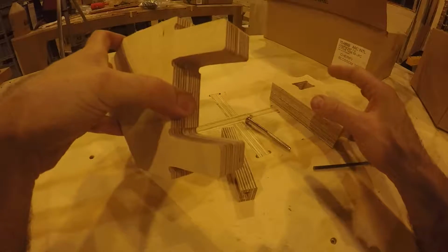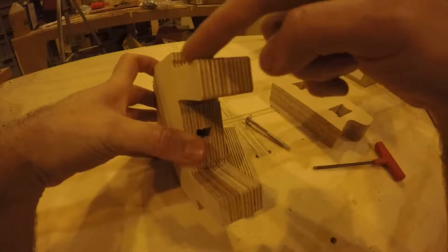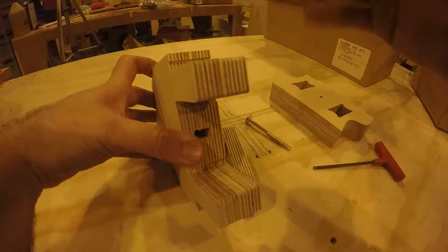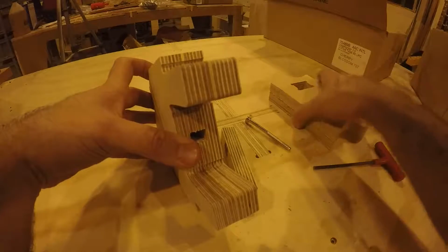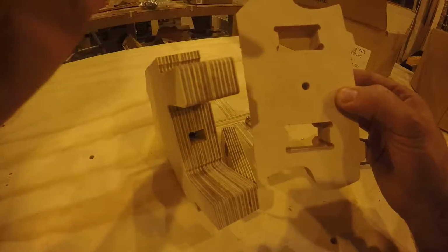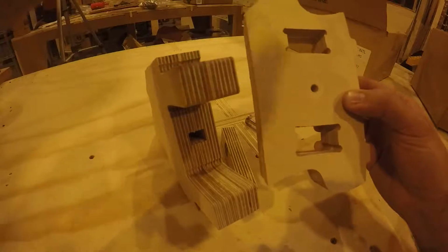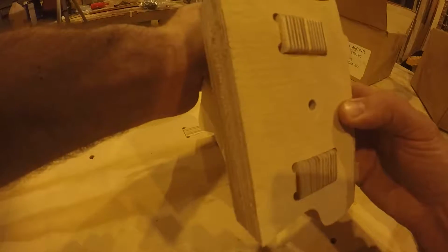The other thing I wanted is, because this is a multiple sheet mill, I didn't want to have to deal with plywood thickness. When you deal with 3/4 plywood, or really any plywood, you can end up with sheets that are anywhere from, I've seen 0.67 inches thick all the way up to 0.76 thick. So what I did is I designed the width of all of these slots to be 0.76 times 2, the maximum thickness that a plywood sheet would ever be here, so that no matter what, when you put it in, it won't bind on the side.